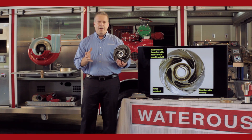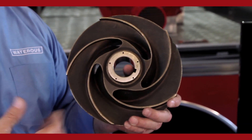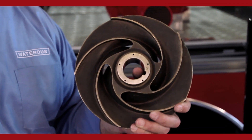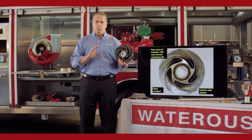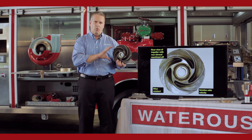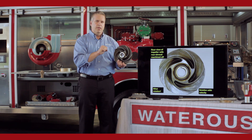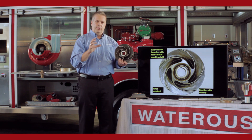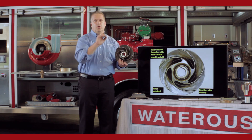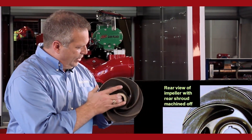As the water is sped up, it's going to be thrown out into the exit way of the pump and then out towards your discharge. Right now, outside of the exit way of the impeller, it's a sealed vessel — the water can't go anywhere until you open up a discharge valve or open up the nozzle on the end of the hand line. When that's all closed, the water being thrown into the discharge side of the pump will create pressure. When you open up a discharge valve and the nozzle at the end of the hand line, you open up that pressure inside the pump to atmospheric pressure. Water is going to seek that lower pressure outside the pump, so the impeller has to rotate in that direction, adding velocity.